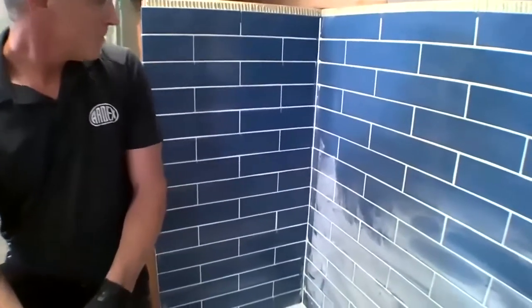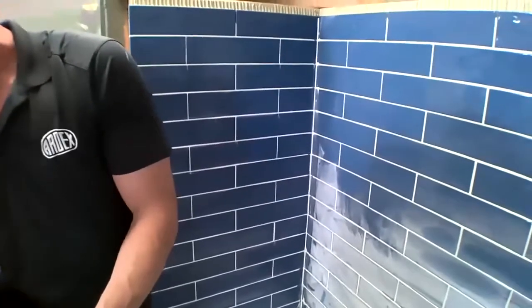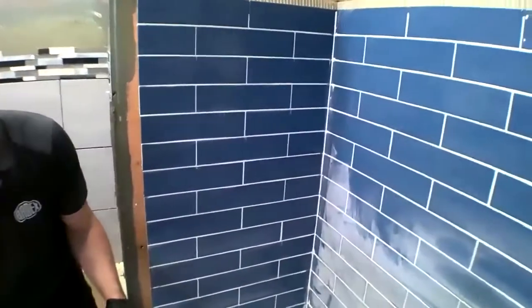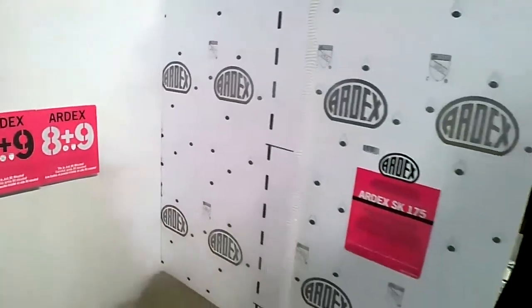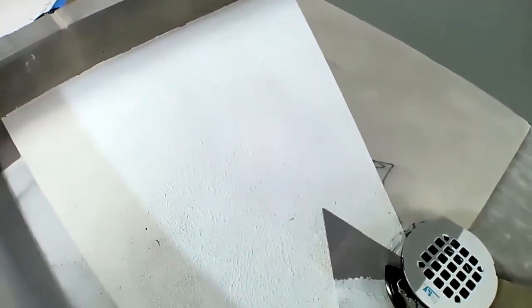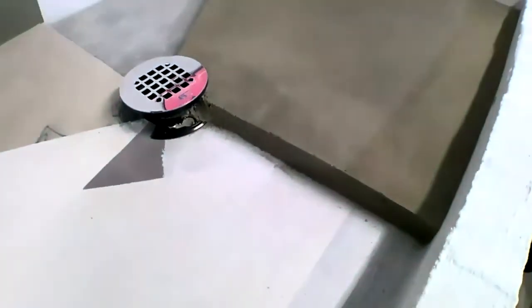Well, that being said, we've basically come up to the end of our presentation for today and this two-part series on ARDEX shower systems. Just as a quick refresher, as I pan, we talked about our waterproofing with S1K, 8 plus 9, and SK 175. We talked about pre-sloping with AM 100. Again, here we show SK mesh used to tie into our drain with 8 plus 9 white. And then we showed packing a pan with A38.